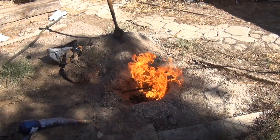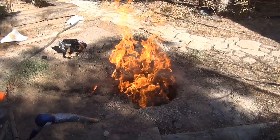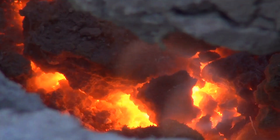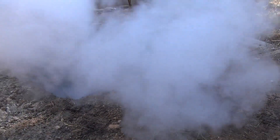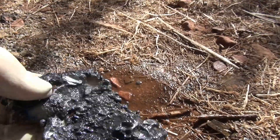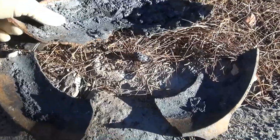After about an hour, you're going to put a plug on it. Then you're going to force air through there, and what that does is it creates higher temperatures. With all that forced air down there, it's going to make that carbon burn even hotter, and it's going to create the perfect environment for reduction. You're going to pour water on it — cool that thing down, look at that steam. Now what you have left is reduced lead; it's got all the sulfur out of it and it's been fused together.